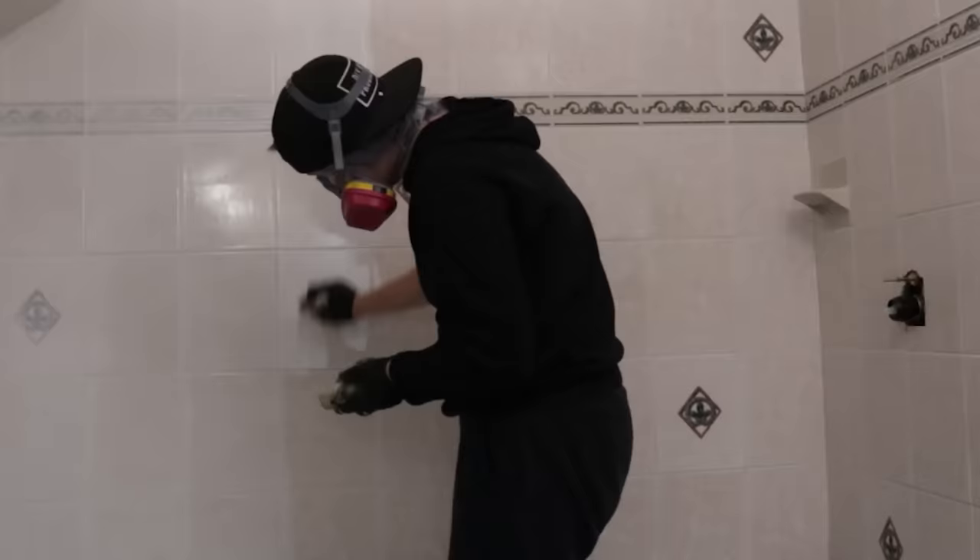In total I did about three separate coats, waiting for the paint to dry between each coat. To finish my DIY day, I put my mask on again and got ready to paint my second coat on the bathtub wall. The second coat definitely made it better, but I could tell it was going to need a third coat. After the second coat though, the tile was looking pretty darn good. Now, the instructions say you can apply it with a paintbrush or a spray gun — I used a brush, but honestly I think all the prep to do it with a spray gun would be worth it for a nicer clean look. If you like a high gloss finish, this tub and tile paint is perfect, but I do recommend you use a sprayer.